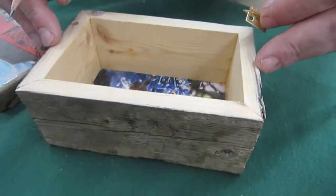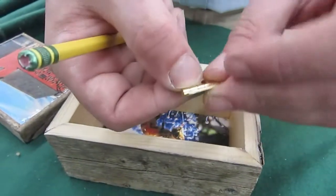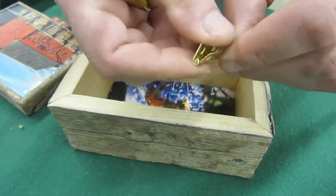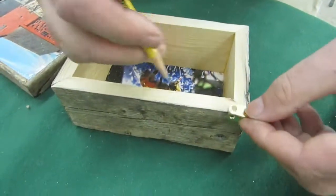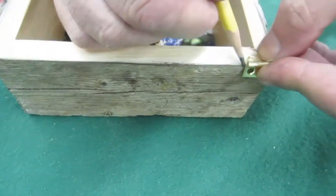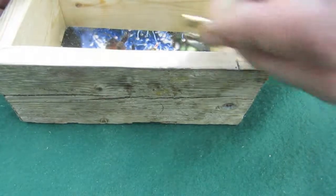Here I'm going to make the mortise for the hinge. A mortise is a small pocket that the hinge sits in. I typically like to make them symmetrical, so I mark them one hinge width away from the edge.